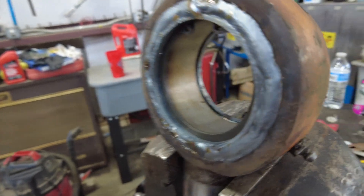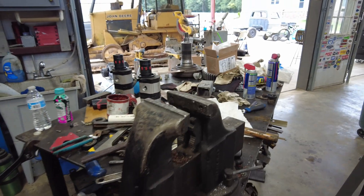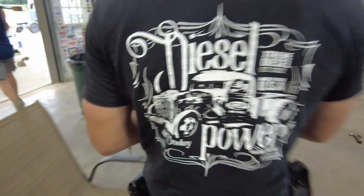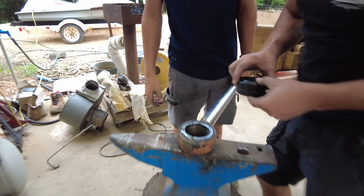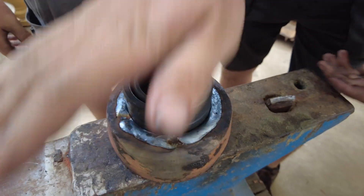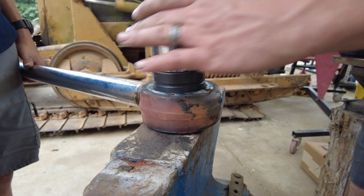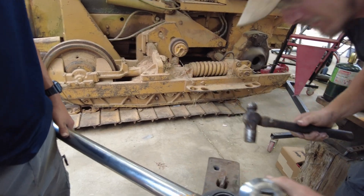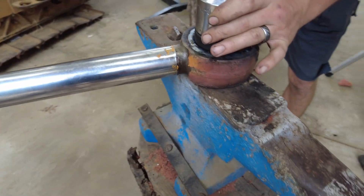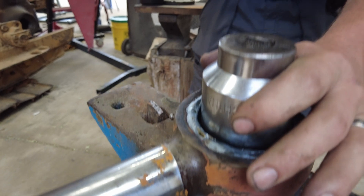We already had a bit of a machining screw-up, but there's one snap ring in place. That thing fit good. Let's take it to the anvil. Well, that sleeve is hot and the bearing is cold, so maybe it'll fall right in. It may fall right in there anyway due to bad machining — no, it'll take a little bit of persuasion but I think it's going to go. Is that going to be a perfect friction fit? Right there — and the snap ring groove looks like it lines up.